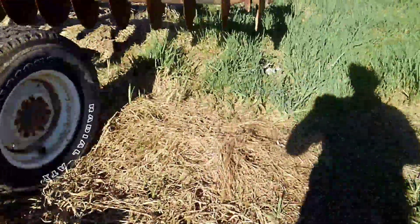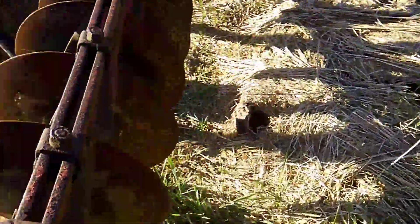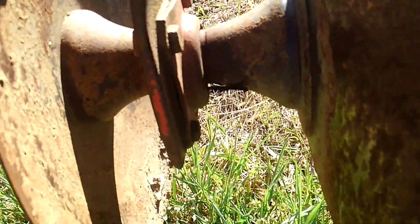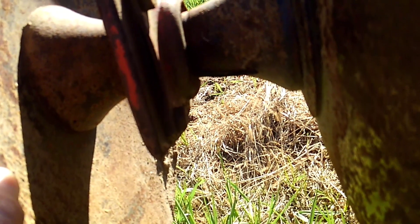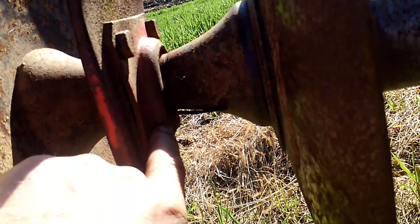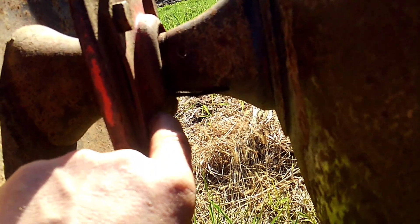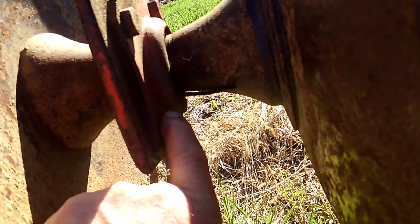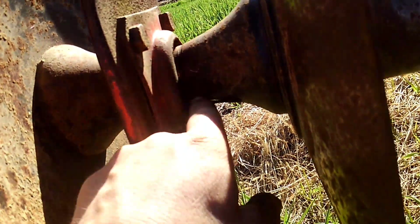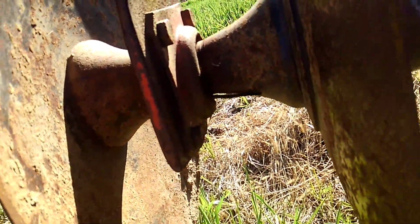I tried to get the discs ready and I found I got a bearing out. That's part of the inner seal right there — it's out. I'm pretty sure I got two bearings on hand. It takes three per gang and if I'm going to tear this apart I really want it done right. I can just change that one bearing if the other two are good. These are all sealed bearings on that gang; every other one I've replaced I put in greaseable bearings.